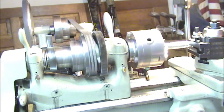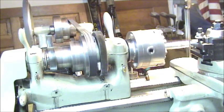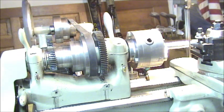Like I said, that click, a little more fine-tuning with the teeth, and you can probably get that right out of it. But it is working. It is a quick repair. The best thing I can suggest, though, is that you practice before you attempt it on your actual back gear. What you can do is go down to the hardware store, grab two pieces of black iron, like a 1-inch nipple and a 3/4 nipple or a 3/4 and a 1/2 inch, and just make them fit inside each other and braze the joint. That way you get the feeling of how clean you need to get it, the heat, and the way the solder or braze is going to flow.